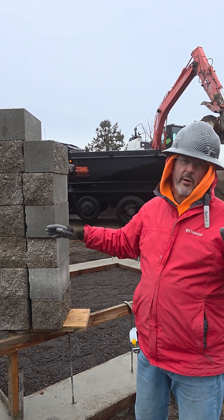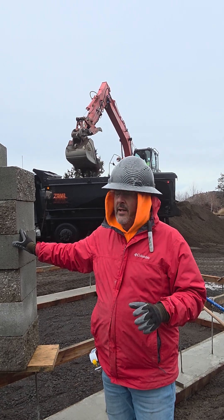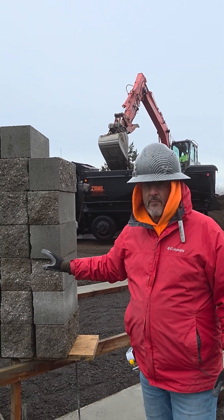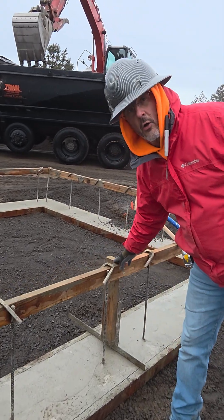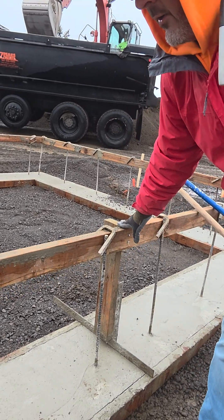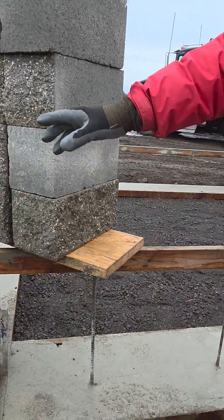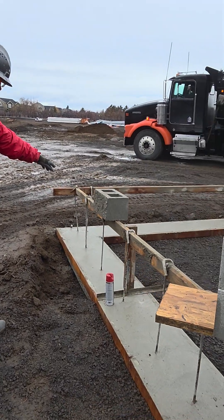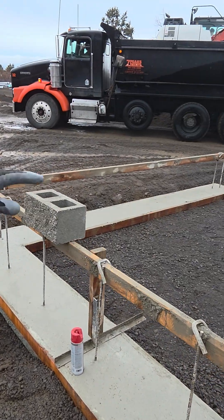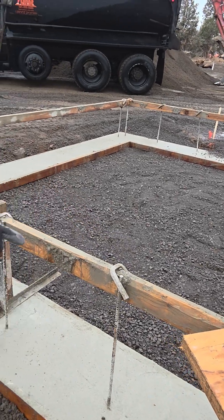They may come up with some goofy thing — they're bureaucrats — but it won't be for structural failure. This is way too strong. I want to emphasize: you have a lot of concentrated load right here, and each one of these braces helps hold it up. Around the corner, here's an individual load. You're never far away from a support in the span, so even if we're loaded at a mid-point, it's still not going to go anywhere.